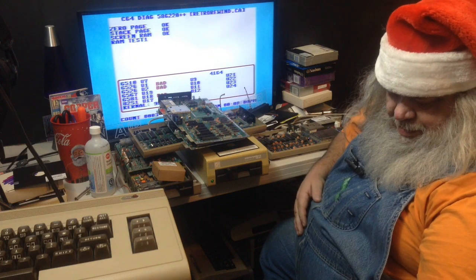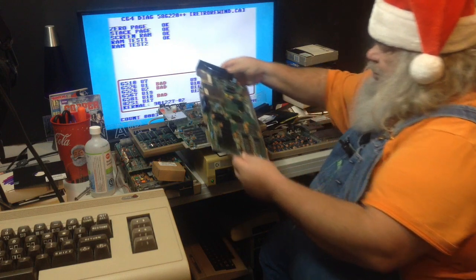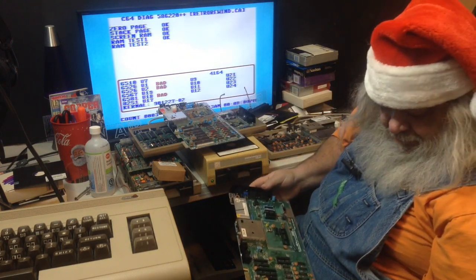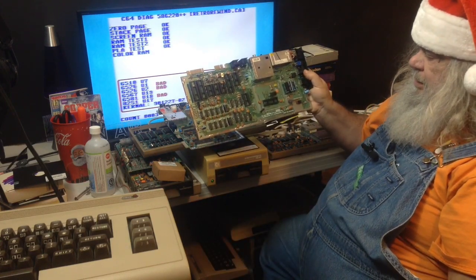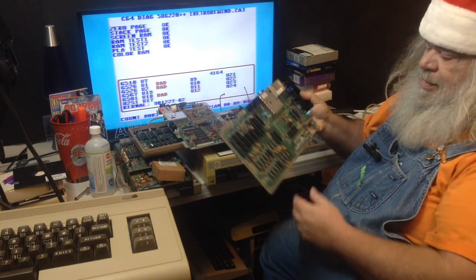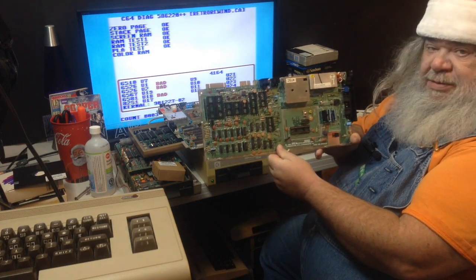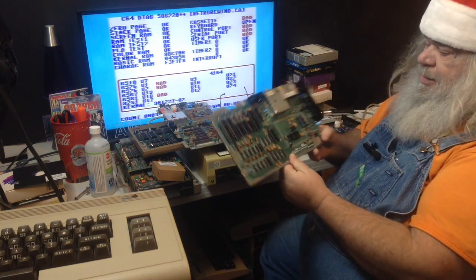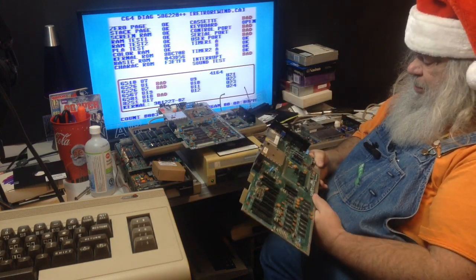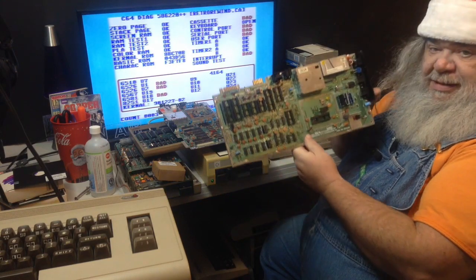I'm going to put this here. There's a dubious stack here going on. And of course, we come upon another one. It's a 250425. And everything of significance is socketed, but also removed. This indicates to me there's a good chance that there's something else wrong. Unless somebody just wanted to score the chips. But I can't imagine somebody who had a working 64 would do exactly this.